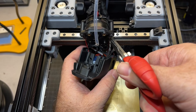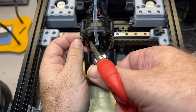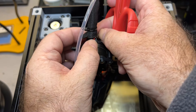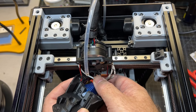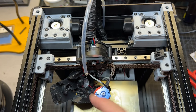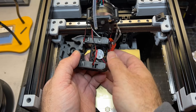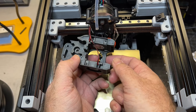I'm going to very gently loosen the loom here — you don't want to accidentally cut into those wires. You're also going to need to loosen up your loom up top as well. We're not going to be using this wire strain relief. Go ahead and free up the hot end from the mount — that should be able to slide out pretty easily. We're also going to need to take these fans out; just be really careful when you're sliding them out because they're in there pretty tight.